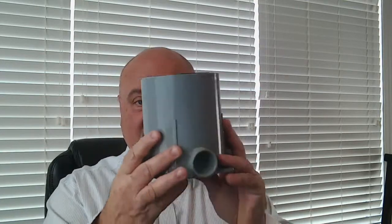And you obviously already have or have heard of the Allied floor box line. This happens to be the FB3. But we also have a kit, and what this kit does is allow us to use this concrete junction box. This was a Carlon. This will also work in an Arlington 4500 series, a Kralloy, or a Lew junction box. As long as the box itself has a 4.5-inch inside diameter, the kit I'm about to show you will work.